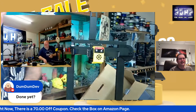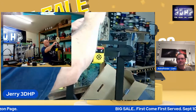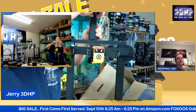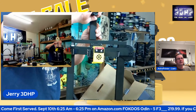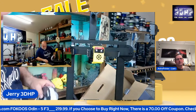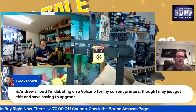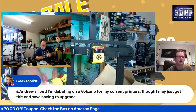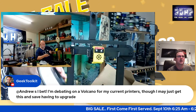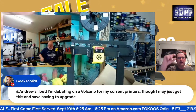Dum Dum says 'are you done yet?' Why be in a hurry — it's fun putting stuff together. Put that in there, give it a quick turn. Ta-da, done. You only turn a quarter of the way, because if you keep turning, you unlock it again. I'll probably have to change that out because I don't want that to unlock itself and the spool falls on the ground. We're debating the volcano. If you want to print at higher speeds or with a larger nozzle, the volcano makes a difference because you can melt more material faster — your heater block is taller. If you're doing a 0.8 or 1-millimeter nozzle, it makes a difference.